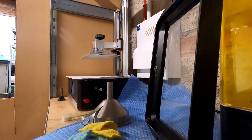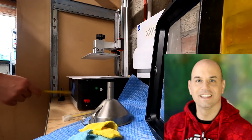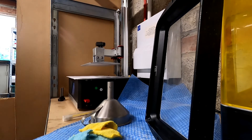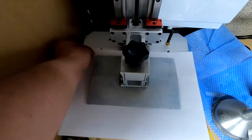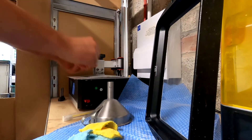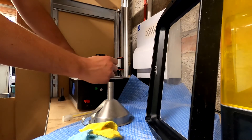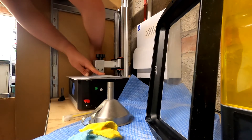Number five — and this is one that I messed up multiple times when I started — leveling the plate. There is an art to it. It's a simple method, but as soon as you crack it, it makes things way easier. 3D Printing Pro has an excellent tutorial on this. In his tutorial, he shows you that when the plate has come down and you've tightened it, you can check whether it's tightened properly by pulling at each corner of the paper. If it doesn't move, it's tightened properly. If it does move, it isn't leveled properly and you have to do it again. Also like point one, leveling the plate each time is another thing you don't have to do. Once it's leveled properly, you can leave it until it stops working — unless you drop it or hit it against something hard, that level isn't going to change.